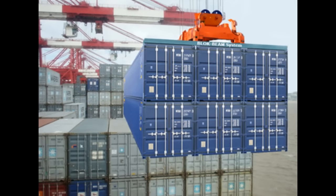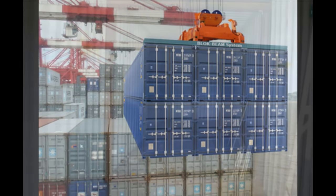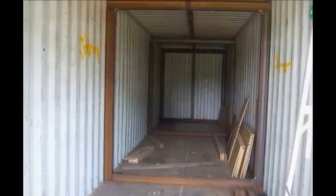Another thing to remember is that the load-bearing capacity of a shipping container is concentrated in the corners, not the walls and not the roof. A container is meant to be stacked like blocks, not with pressure on the walls. The sides and the roof can be crushed, so the sides of your container should be securely braced.